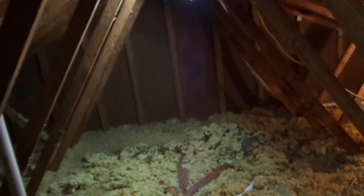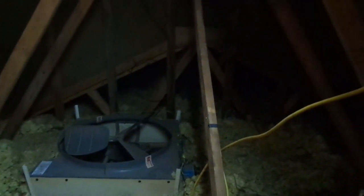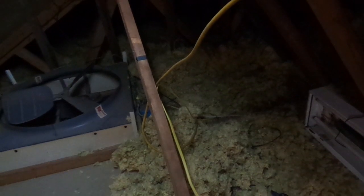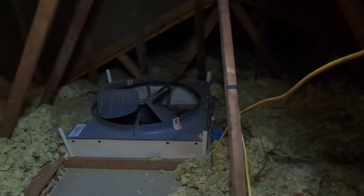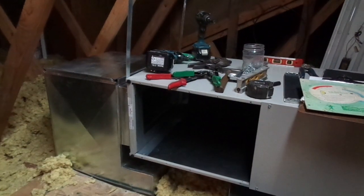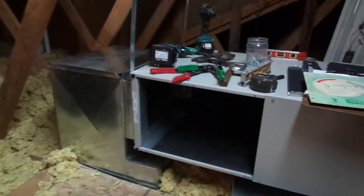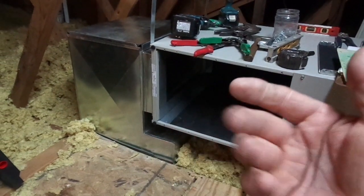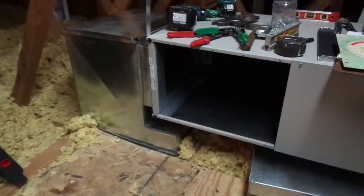We have to prepare the attic fan, and also to prepare for the job because it's so dingy. I came down and put a couple of temporary lights up here so I can see. There's still a third area — a three-and-a-half-foot crawl space over there that goes to the far end of what's going to be an additional bedroom. The duct work is going to have to drop down, go in either direction through that opening, and then back up the direction where I'm standing. Yesterday we got the air handler actually hung in the attic, the return air grill up through the ceiling, the offset fitting installed, and the end cap and dovetail connection connecting the return air opening to the back end of the air handler.